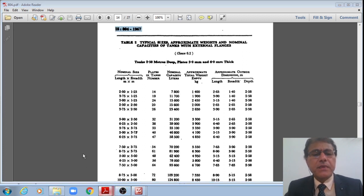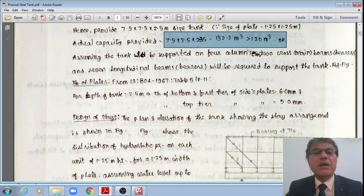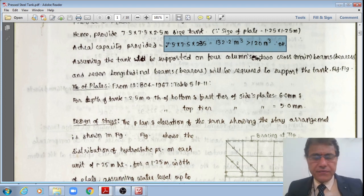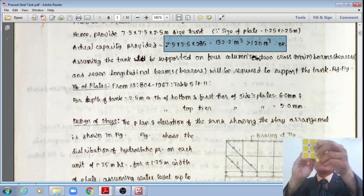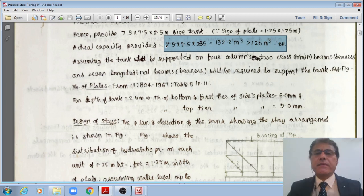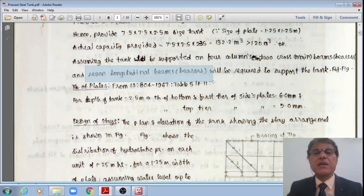Now, coming to the tough one, the discussion student: we have just fixed the size of the tank as 7.5 meter by 7.5 meter by 2.5 meter. Now, what I'm assuming is that because I do have six number of plates, therefore under each plate I must have one support. Therefore, 6 plus 1 longitudinal girders must be there, right? Therefore, that is what I am assuming. I am fixing the other geometry, right? I am fixing 7 longitudinal girders, or bearers, or beams, or girders,